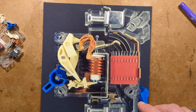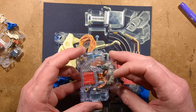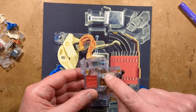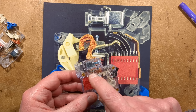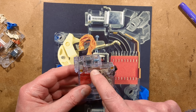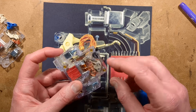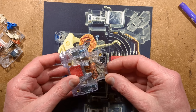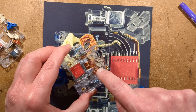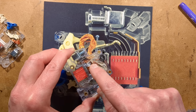If you look at the 63 amp circuit breaker, they've got a big huge piece of braid going from the bimetallic strip. It's tacked on — not onto the bimetallic strip itself but right at the end, so it must be the heat of the braid and the assembly itself that heats the bimetallic strip. To carry that current but still allow contact flexibility, they've got the braid centre spot-welded onto the contact, and then both ends have been spot-welded either side of the metal bus bar that's been wound around the solenoid.